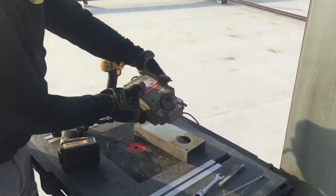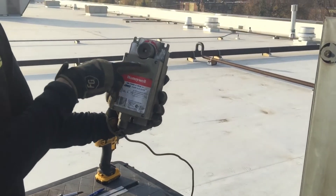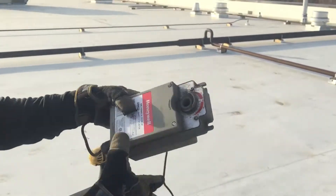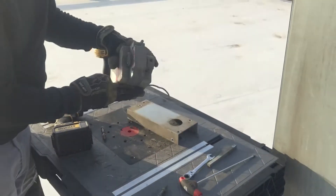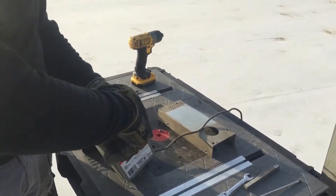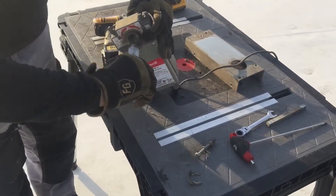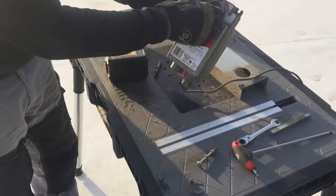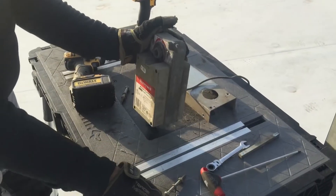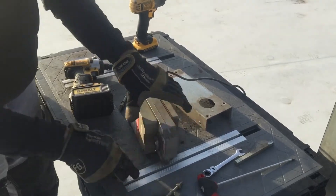What I'm going to do is flip it. You guys can see the arrow on here — this is the way it spring returns. I'm just going to flip it to the other side so it spring returns the other side. To do that, I just got to flip the little gear. I don't have to, but it makes it easier to install. So if I pull that clip, slide this out on one side, slide it in the other side — noting that it's straight and square, that's how it came out. Now I just got to snap this clip back on the other side.